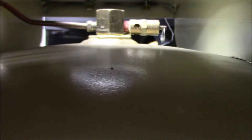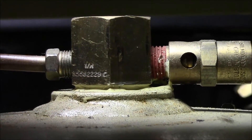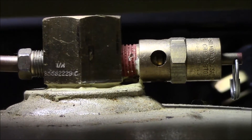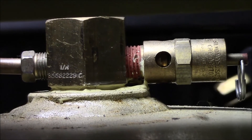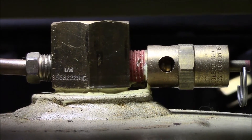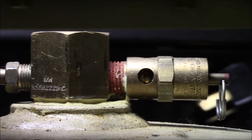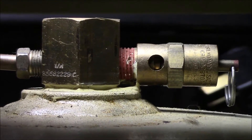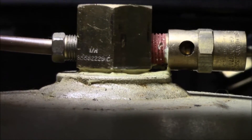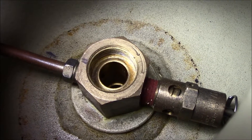I had a leak for several months right here at this fitting, so I went ahead and redid all that — took it out, cleaned the old sealing out, and put new pipe thread sealing in. There were a few threads missing down next to the bottom where they cut it. It wasn't really rusty but it worried me a little bit; it did tighten up fine though, so maybe it's okay.